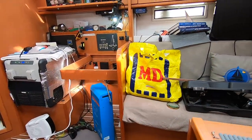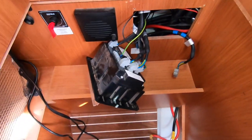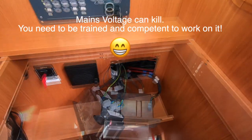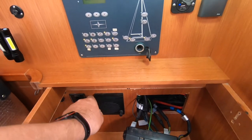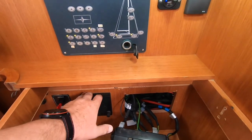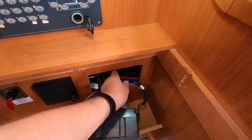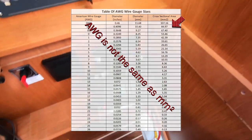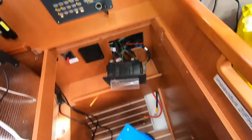So we have the chart table apart — that's over there. And what we're doing is working with mains voltage. So if you are not competent or not happy working with mains voltage, switch off now. We have our 12 volt cutoff switch for our lithium, this is our speaker to our Garmin VHF, these are the mains cables in, that's the Earth. Those two there are the old 70 square millimetre cables for the old inverter, which went in here. This one is going to go in here — I've got to make a standoff piece for it, and it was easier just to take the chart table out.